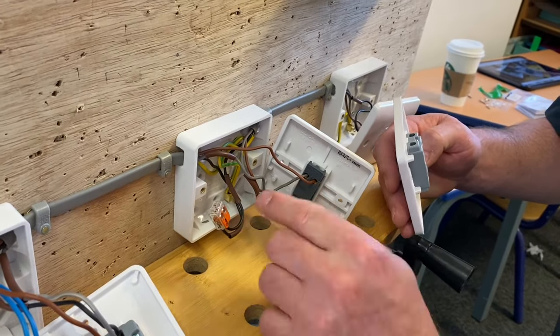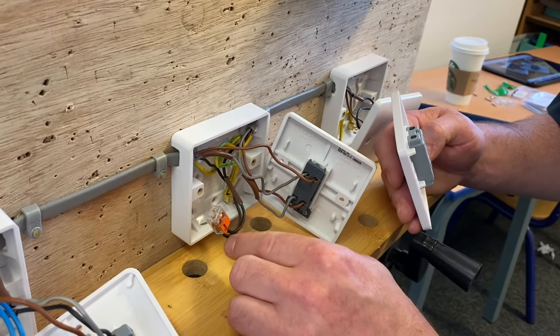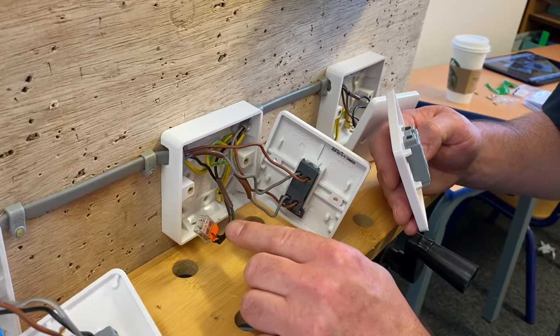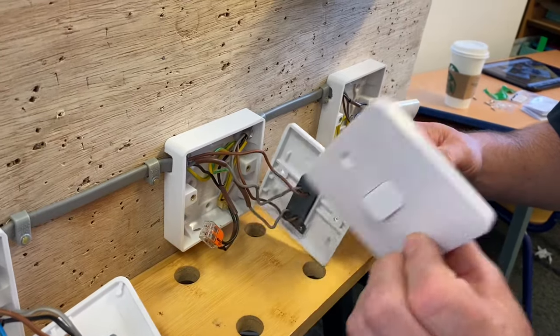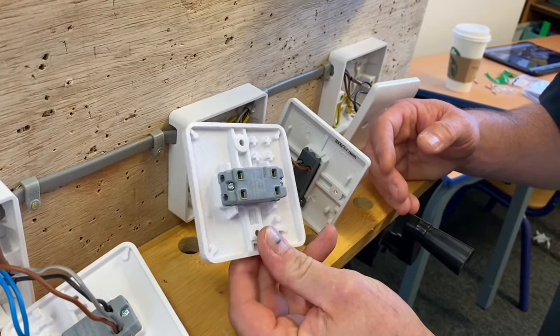That was a bit of a letdown. I was expecting to have an extra terminal. If you look at the two switches side by side they look remarkably like they use the same frame, so the intermediate switch would be this switch with that loop terminal added. But they haven't included an additional section anywhere for those connections, so they'll have to stay in my Wago 221. If you've been using the Hager one and the Hager intermediate switch has an extra connection, please leave a comment below and I'll perhaps buy and investigate that.